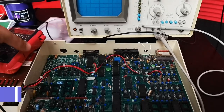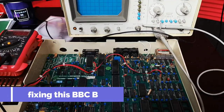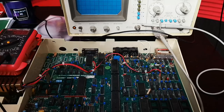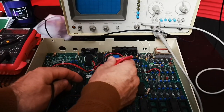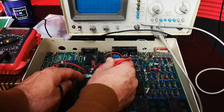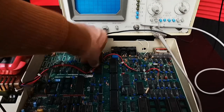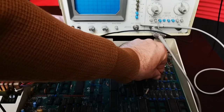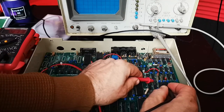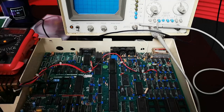First off, we're going to do some simple checks using a digital multimeter here, just to make sure everything's connected right. I've got a feeling that there's a five-volt rail which isn't doing what it should do. So we're going to take a basic multimeter and check the voltages across here. I've got 4.92, 4.82 — fluctuates a little bit, but it's not far off. So that shouldn't be causing any issues. Doing the same across here, again fluctuating a little bit, but we've got the correct voltage there.